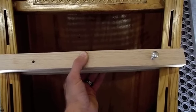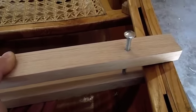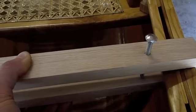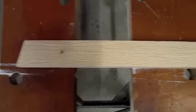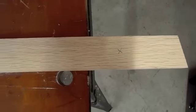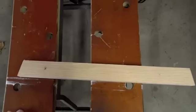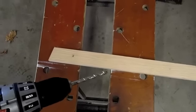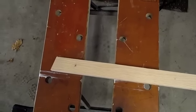After you've got your top holes drilled, all I'm going to do is put in one of my carriage bolts. I'm going to push in hard on it to mark the bottom board, and do the same with the other side so that will give me a good lineup of where to drill my next hole. The carriage bolts I'm using are quarter inch by three and a half to four inches — just make sure whatever length you get is long enough to go through both pieces of board. Do yourself a favor and go up a drill bit from a quarter inch to give yourself a little extra slop, as the main strength comes from the compression and not from the side-to-side orientation of the hole.